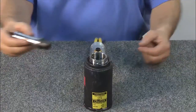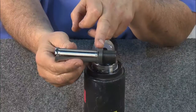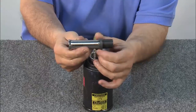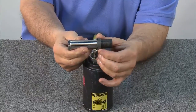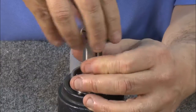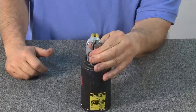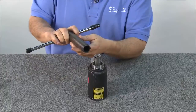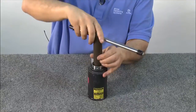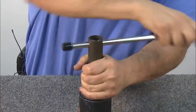Turning the tool upright, first install the puller. The puller assembly is made up of the puller itself as well as a jam nut. Be sure the puller is completely extended from the jam nut without it coming off — this will ensure the puller will bottom out in the anvil. Install the puller, keeping in mind it has left-hand threads. Rotate it in until it bottoms out. Next, using the puller wrench, tighten the locking nut by putting the wrench directly over the top of the puller and turning until it tightens completely. Be sure to tighten it to the recommended 70 to 75 foot-pounds of torque.